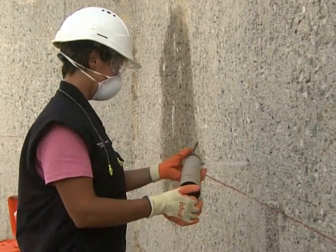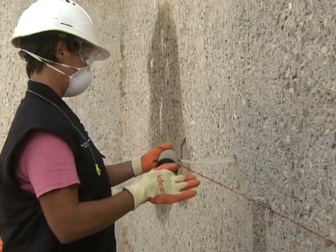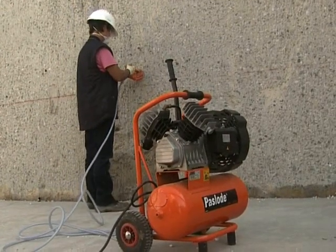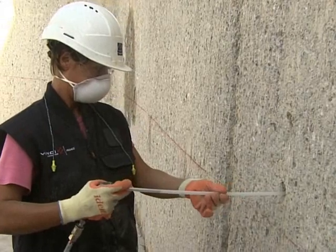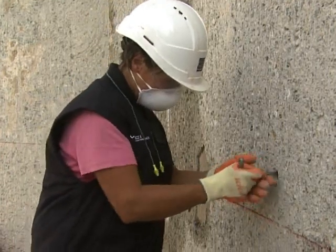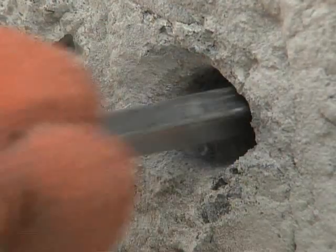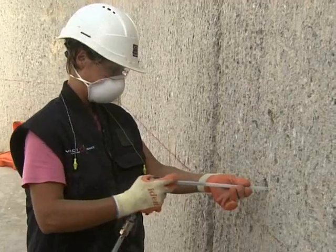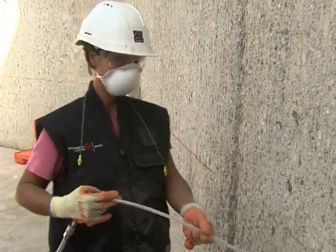How to do it? First of all, blow out dust starting from the bottom of the hole. In this way, the dust at the bottom of the hole is removed. This operation can also be carried out with compressed air. Only the dust sticking to the sidewall remains — this needs to be removed with a wire brush. The blue nozzle must then be used again to make sure all residue is removed. The hole needs to be very clean.